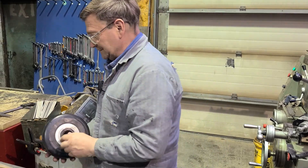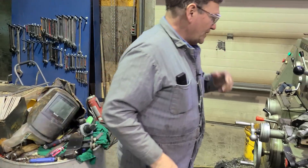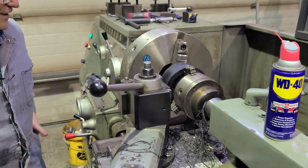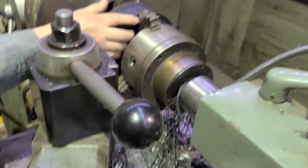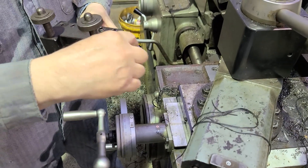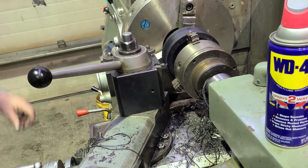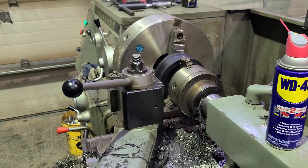The reason I didn't want to do it on the lathe is that taking an eighth-inch cut at a time takes more time. While this part may be expensive, and the people who made it said it would be cheaper to have it turned, they're not paying my wages. I like to give the best deal for the customer, so the hole saw would have been quick. But we can't do it because of the seal. So now we'll go ahead and watch a layer peel off at an eighth of an inch — though I'll need to grind part of this tool away before I can go to the full diameter near the tail stock chuck.